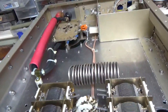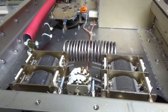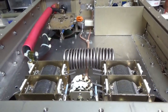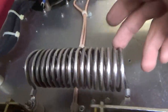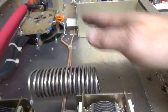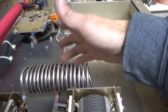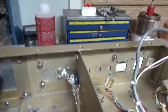Okay so I'm back — I'm done for the day. Two more amps showed up, so I had a little while to work on this — two and a half, three hours or so. Everything just takes time, just to do it right. I'll have the coil in. I ended up repositioning one of the standoff locations so I'll have to plug that hole. I'll have to see if this tunes up on 160 meters with the proper Q, and then I'll tap it. I installed the RJ-1A back there.